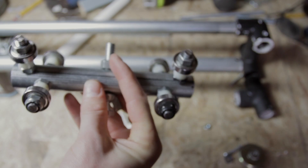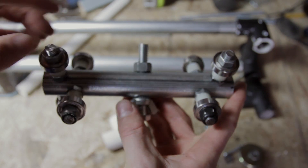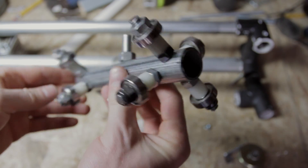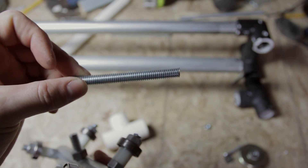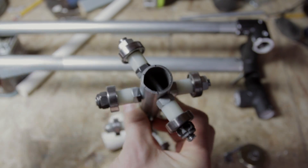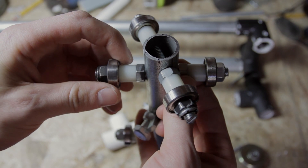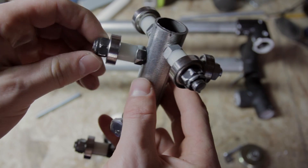You're going to do that to both ends of it. This piece is only about six inches long, so it's relatively short. The center is going to be where you'll actually mount the head to your tripod so you can put the camera on top — that's just drilled through the center there. Once you've got those holes drilled, you need to take pieces of threaded rod like this, and those threaded rod pieces are going to fit through the conduit. Then you're going to attach nuts onto both ends of it. These are just nylon spacers — you can get them pretty cheap. I actually cut them in half; they were inch long, so I cut them down to about a half inch.